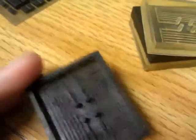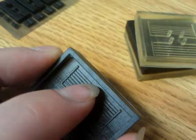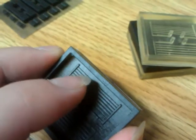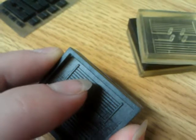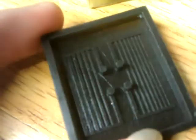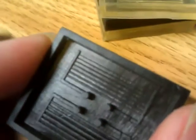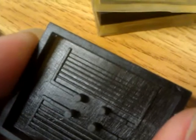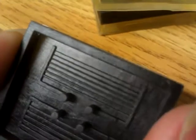We can see here that the smallest channel didn't print out because it was a 50 micron thin channel. And 50 microns represent on this printer one row of pixels, because it's a projector-based system. When it's only one row of pixels, the light is too weak to cure the material in time.